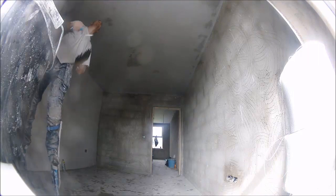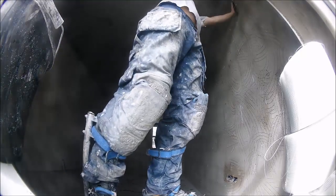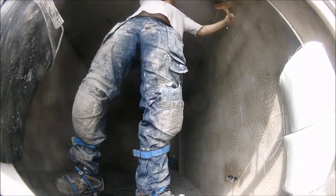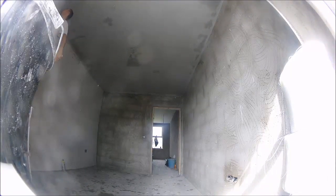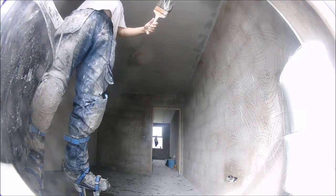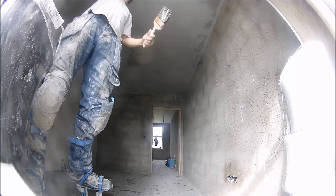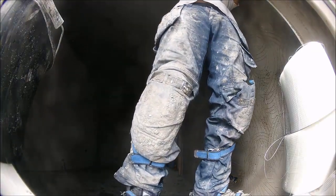That's more or less the ceiling done. I could probably do this video again with a bit more detail and break it up further. Hopefully it's a bit of a help to learners and DIYers — ceilings are definitely not the easiest task. But if you're doing a whole room, you must start the ceiling first, not the walls, as it will drip on the walls. You don't want finished walls and then drip plaster or dirty water on them — same as painting, start the ceiling then do the walls. The ceiling will go brown and then it'll dry white, ready for paint. Hope it helps!